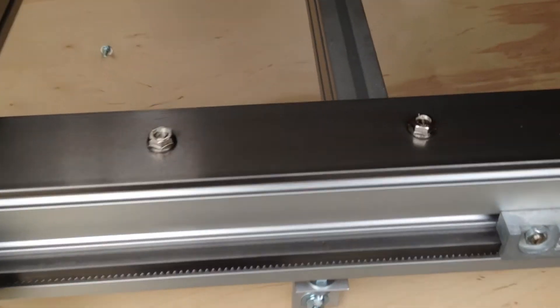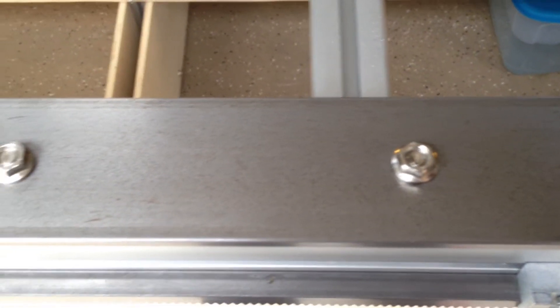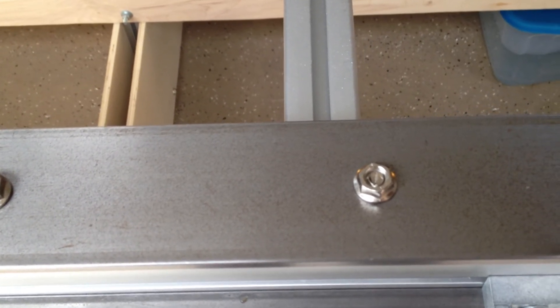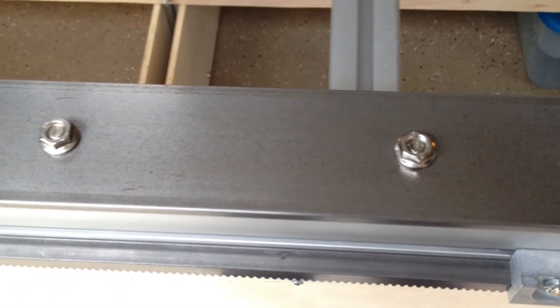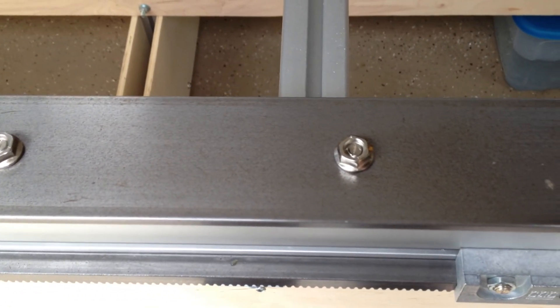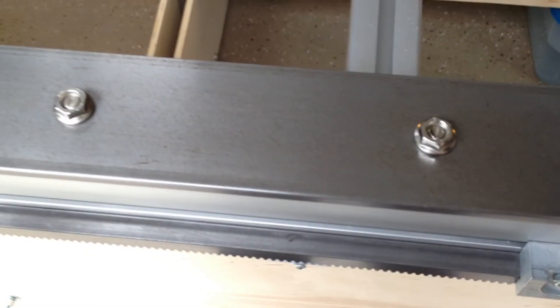One thing I noticed is a little bit of corrosion starting to happen on the rail. I've been doing my best to try and keep these things coated in WD-40, but I think I'm going to go ahead and get some table saw wax and wax all that up good. That should last a whole lot longer than anything else, except maybe painting it — but I can't paint these edges where the bearings ride, and that's all that's really important.